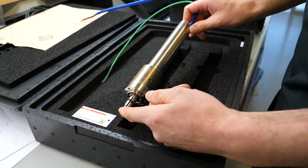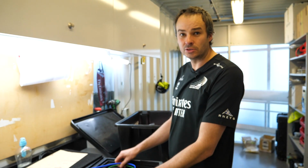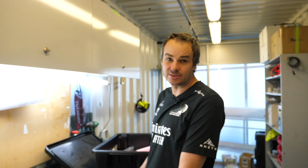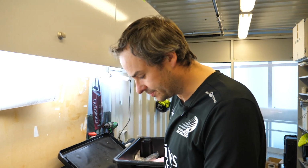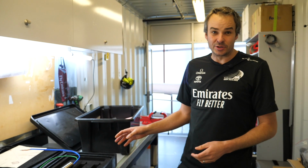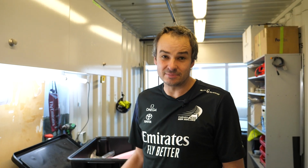This is the 480 watt Maxon motor with the 42mm HD gearbox. We're pairing this with an EPOS 4 motor controller. What we really like about this motor is its size and the power it provides for how compact it is. Now I'd love to show you in more detail what we're going to do with this motor, or a number of these motors, but this is the America's Cup and we can't go into too much more detail than that.